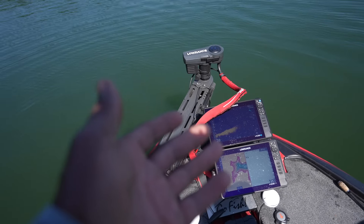Notice I've got a battery missing. I had a tournament this past weekend and one of my batteries failed on me. Luckily, since I run a trolling motor capable of running 24 or 36 volt series, I was able to take that battery out of my series. Normally if I'd had just a 36 volt trolling motor I would have been dead in the water — tournament over. Even though it took me a while to diagnose what was going on, I was able to continue fishing.